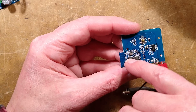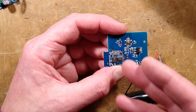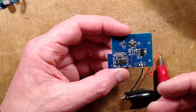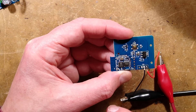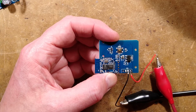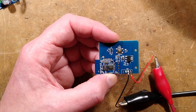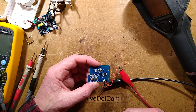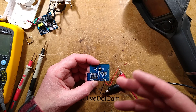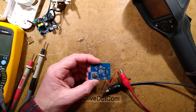I'm pretty sure that the problem here is the little microcontroller — it should be fairly low power but it's notably warm to the touch, so that's what's caused this to fail. I'm not sure what triggered that. It could be that when someone pushed the button, an electrostatic discharge from their finger went into that chip. Or it might have been some transient finding its way through the power supply, although it does look isolated. So my guess is electrostatic discharge or just a natural failure. It's a shame — it's wiped out a product and you can't really just replace a component to repair it. It doesn't look like a hugely expensive device, but this has failed and it can't be repaired. I hate things that I can't repair, but there we go — it happens from time to time.